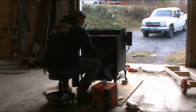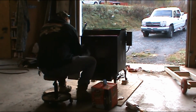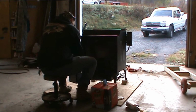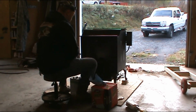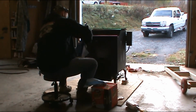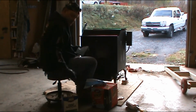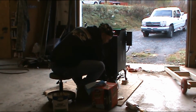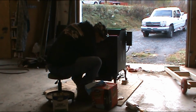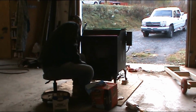I know there are a lot of people who might sand first, and my caution against that is you could actually be sanding, and I know you're supposed to be wiping in one direction, but there's a lot of rust on this thing, and it's really doing a number on my rag. But anyway, you're supposed to sand, or would start sanding right away and then wipe down before they paint. For the best results, I recommend doing both, because you run the risk of sanding your oils and stuff down into the paint that's already there, and then you'll never get them out.